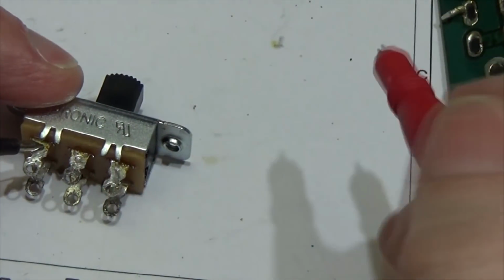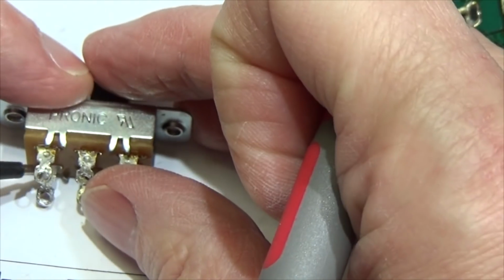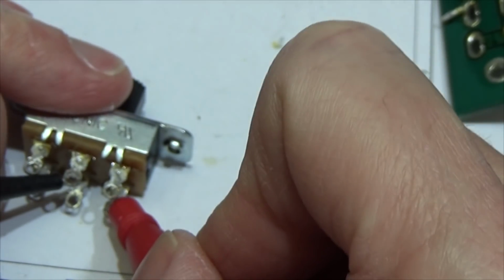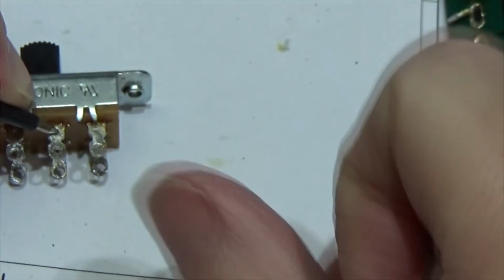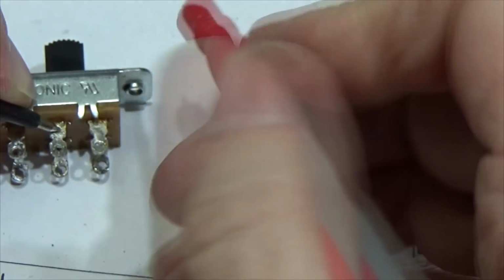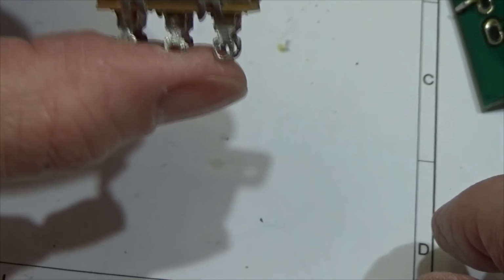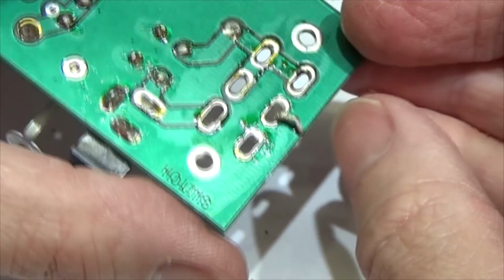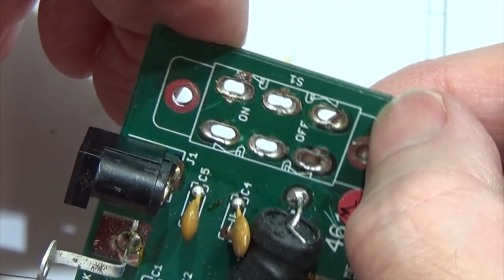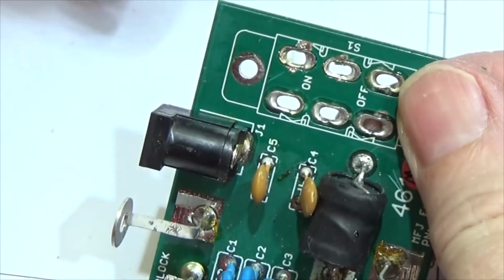And you remember when it was in, we had suddenly on 3 pins here a connection, which is of course not right. And now this upper side is okay. So that means normally you would feed your positive voltage, let me say here, if you flip it down, here is no contact. If you flip it up, then you have a contact. So that is the normal behavior of our switch, so no problem. But then again, what the heck is this here? So I take it out, and somehow we must have had connections here somehow.